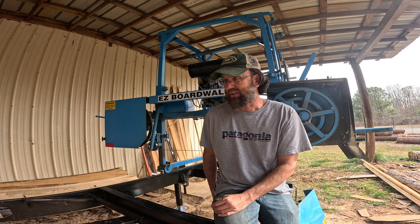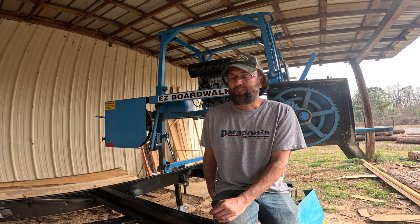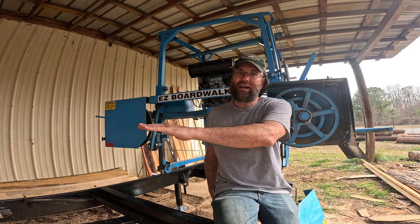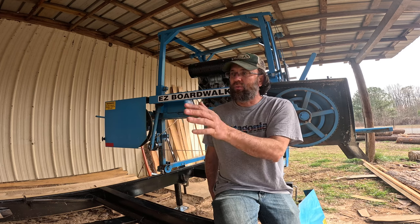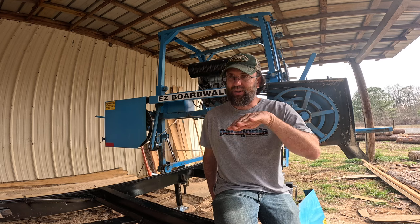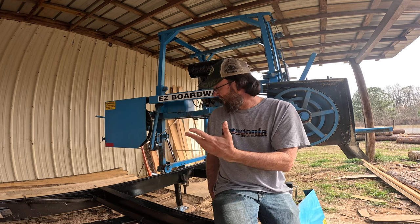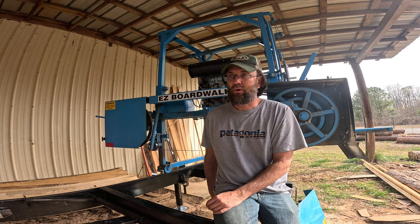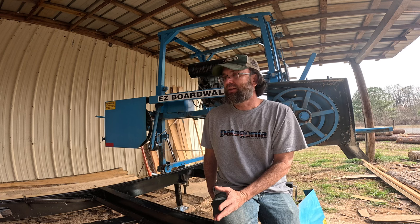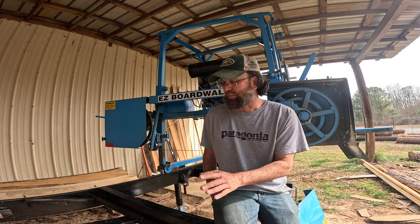Almost all the other sawmills, I think actually every other sawmill I've seen, are set up that way. This one is the opposite. You set this log on here, cut that first top off, and then rotate the log, and every other cut, the other three cuts, goes into fresh cut lumber on that exposed cut. And that's all you do. You go through the bark one time and that's it. So it's a pretty good setup, because that keeps your blades lasting longer and staying sharp longer.